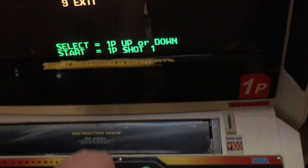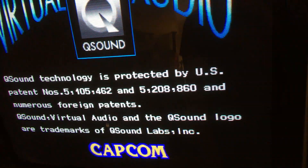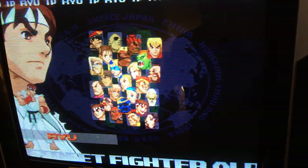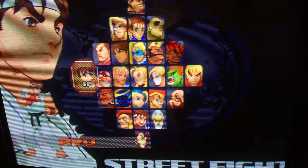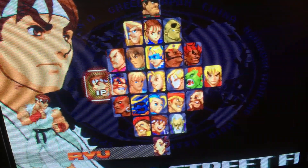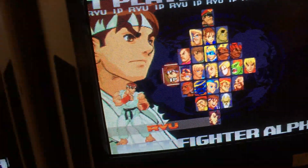I'll load up a game just to see that it works. I have not yet tested the kicks, so this will be a big deal if those don't work for me — but they probably work. The stereo audio is good. I used to have a buzz in the older version, but I've given audio its own ground and now it sounds good. I don't hear any buzzing from the video coupling in — no ground bounce, so that's good.